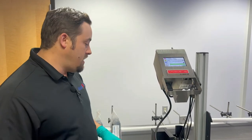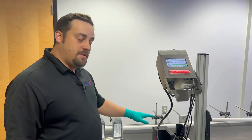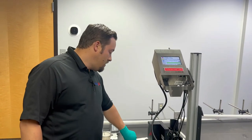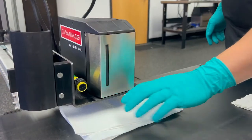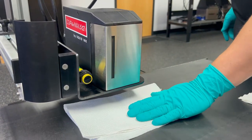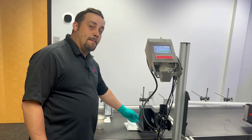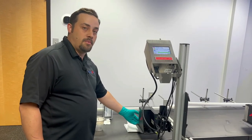When you're ready to start your commissioning process, what you're going to want to do is either place a catch container in the front of your print head, or if you have some spare paper towels or something that will not make contact with the print engine, you can put them in front of the print head so that it catches any ink that may come out of the nozzles while we're doing the process.